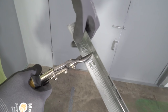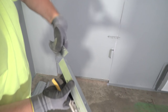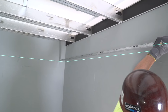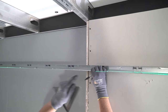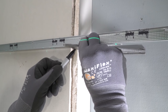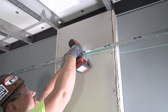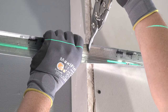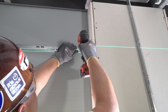As we install locking angle mold on the opposing wall, parallel and opposite to the first wall, we will again cut off the first four inches to the center of the first locking tab. This will guarantee our tabs line up across the room. If there are any columns or jogs in your wall, you will need to make sure not to install locking angle molding to the 90 degree returns — just the portion of wall that faces the opposing wall. Simply cut your angle at the jog and push the locking angle back or pull it forward.